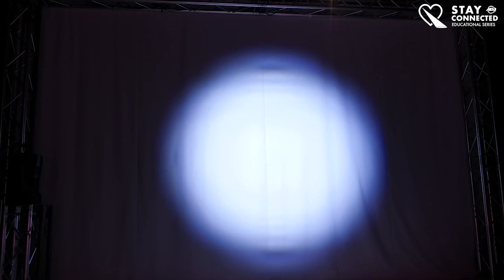Victor asks how far the unit is from the wall — right now I'm at a 23-foot throw distance. With the 6Z's 300 watt, 10,000 lumen chip you can shoot a lot farther than what we're doing now. So let's recap what we talked about: color, gobos and gobo morphing, the zoom range, the focus, the motorized iris, two different frosts — light and heavy — circular prism, linear prism, and those cannot be stacked on top of each other either, just to keep these units as compact as possible with the most feature sets possible.